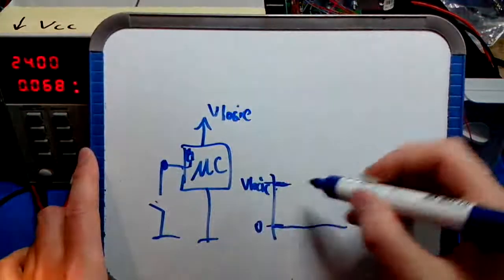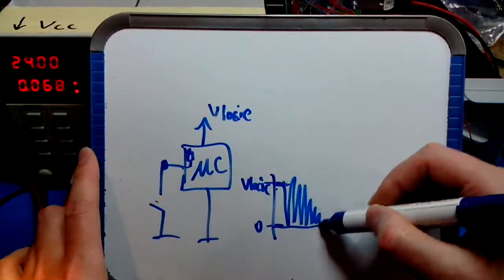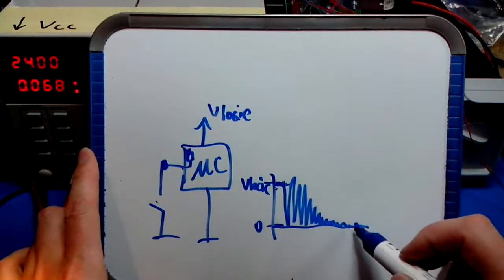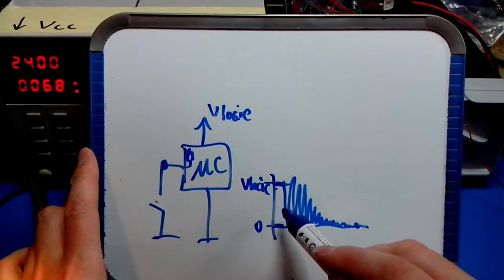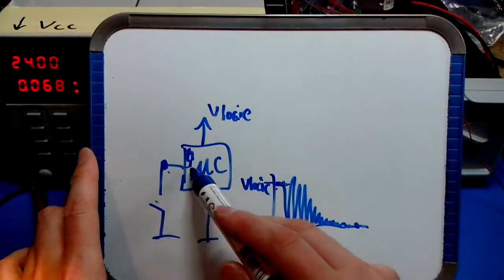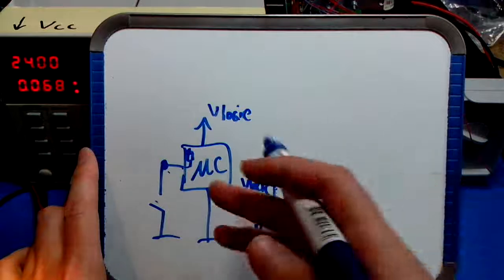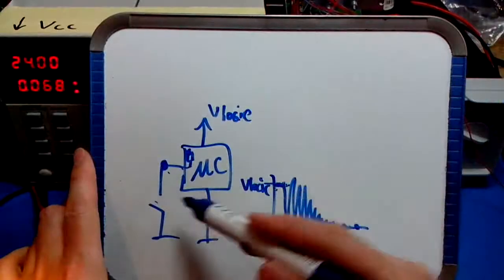Okay. If you close the switch, you will see the switch start to bounce around, and eventually the voltage will reach, well, near 0 or 0, and that's fine. But in the meanwhile, if you would take literal, periodic samples of the voltage at the microcontroller's input pin connected to the switch, you would see erratic behavior, and you would not see one nice edge, but instead you would see multiple edges. So there are several methods for solving this.